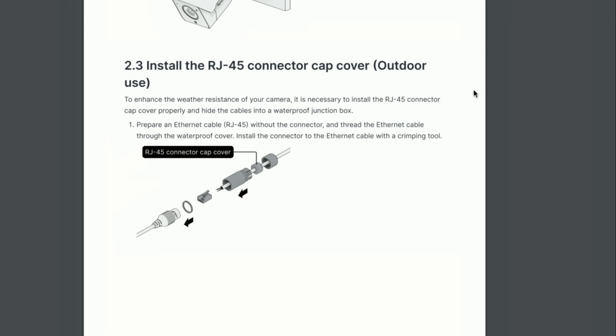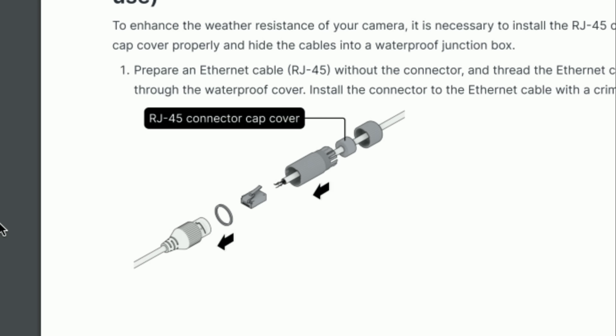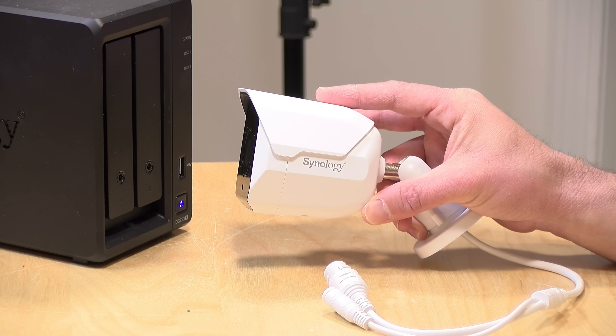There's no Wi-Fi option on this camera so you do have to have it physically connected to your ethernet network. You will be running ethernet cable outside your home, which is why it's easiest to use PoE to power cameras like this. They really depend on you to terminate your wires at the time of installation — they want you terminating things after you slide the weatherproof housing over. It's difficult to get a pre-terminated cable through the tolerances of the weatherproofing, so get your crimpers out and make sure you've got some aptitude for ethernet crimping.